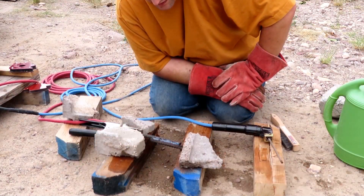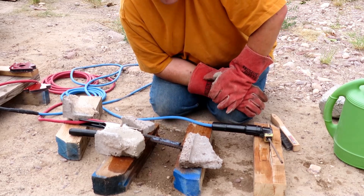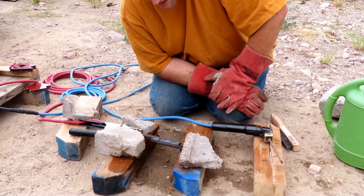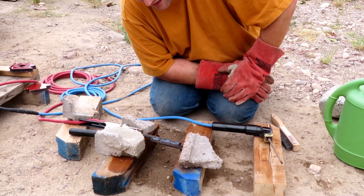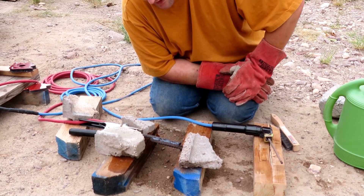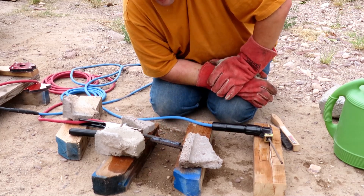Yeah, it looks pretty darn good. It's not perfect — I don't have a stack of dimes or anything like that. I've got to work on managing the puddle and handling this a bit better, but practice will fix that. I actually really like this setup and will probably use it quite a bit. I like how portable it is, and it is powerful. I'm using a 5/32nd electrode, which is pretty big, and it has no trouble delivering the power needed. I'm going to get a 3/16th electrode and try that as well — it moves quick, really quick.